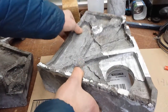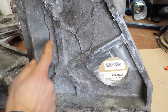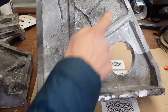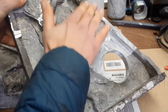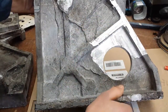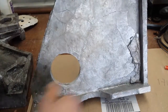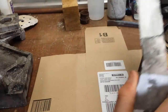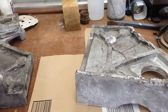Here is the first casting. You can notice along here there are some interesting ridges, and this area is quite proud — that's where it blew up. I've milled out down here, it was the same down there. I've done a bit of milling around here just to clean it up. There's a little bit of shoddiness here where I didn't vibrate the sand fully into the corner. Apart from that, the surface finish is not ideal but okay — that's been pressure washed.